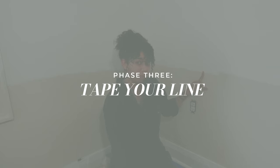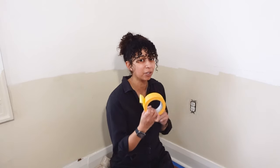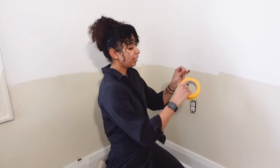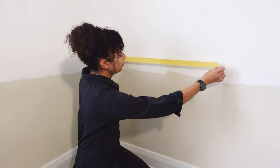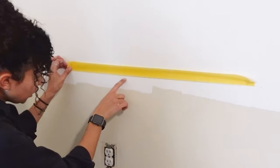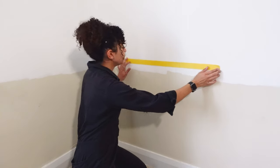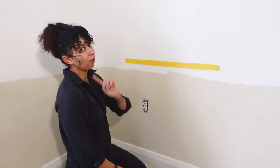Now that I've got my line drawn on the wall, it's time for tape. Since I just painted this recently, I'm going to use a delicate painter's tape. But if your existing color was already on the wall, any painter's tape should do. Take a piece of tape about an arm's length and put the bottom of that piece right above the line we just drew, making sure the line stays on the lower side so it gets covered up by your bottom color. Press really firmly to make sure there are no air bubbles or anywhere the paint can leak underneath, then do that all around the room.